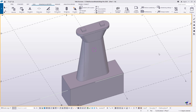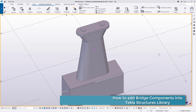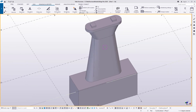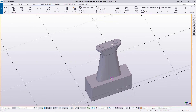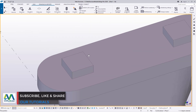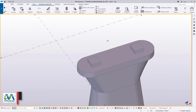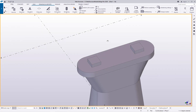Whatever you see on the screen here is a bridge bent or a concrete pier. At the bottom end here you can see we have a pad footing for our pier or concrete bent. On top you can see concrete pedestals, and these pedestals normally provide a seating for our bridge or a seating for the bearing.